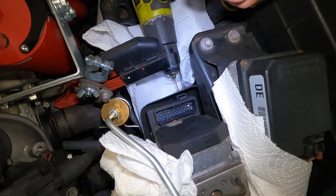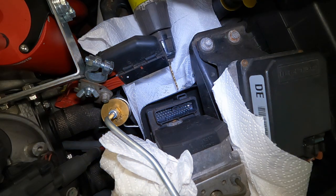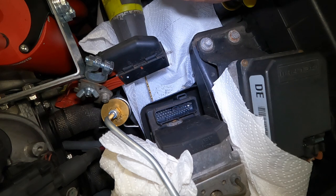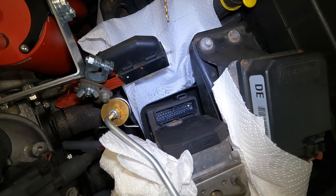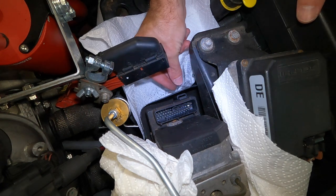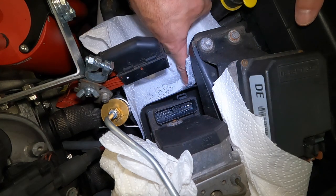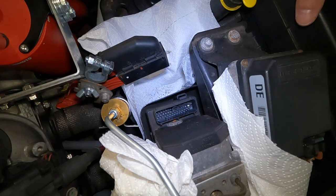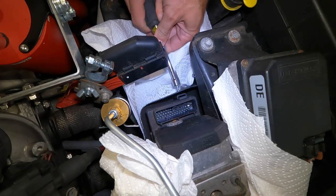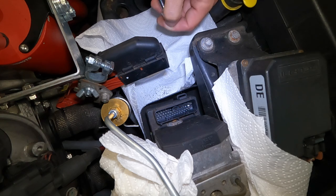Directions don't tell you what size drill bit to use, but 1/8 inch looks like it'll work — so drilling that out now. Then for good measure, I'm going to start the self-tapping screws that come with the kit. They seem a little small but I'll let them do their self-tapping. Using a 5/16 nut driver to work them in — they're cutting nicely. I'll back it out and start the second one.